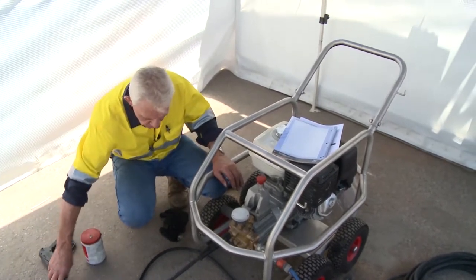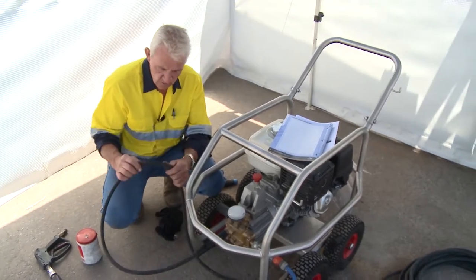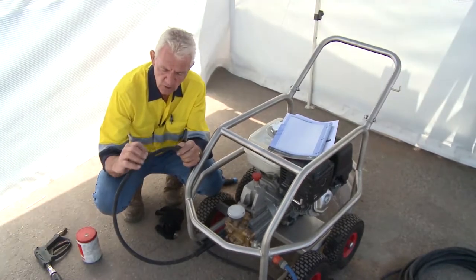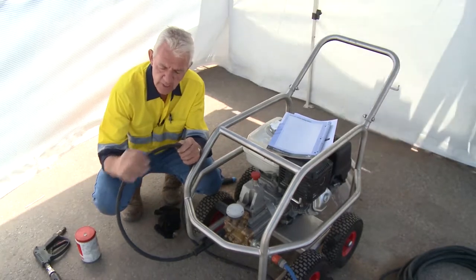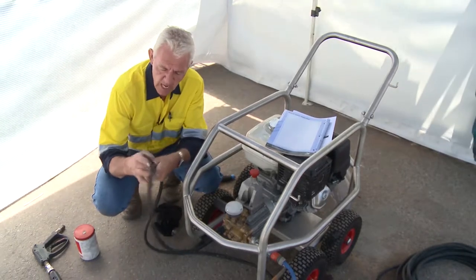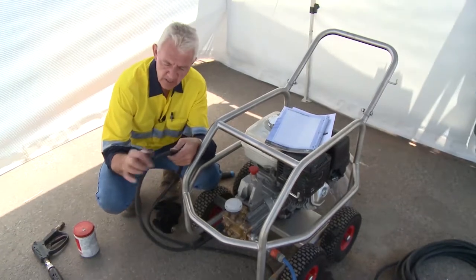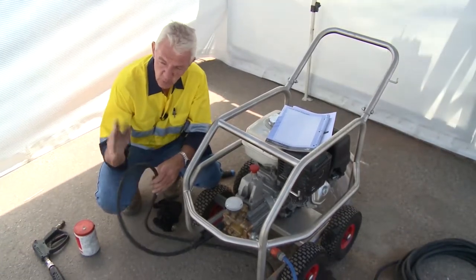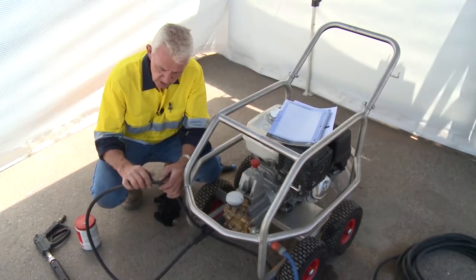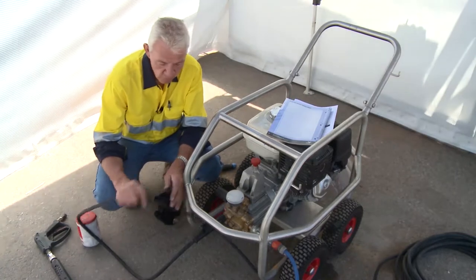Never use a hose rated less than the machine's pressure. These hoses are constructed like hydraulic hoses — wire braid around an internal lining with swaging on the outside. Hoses cannot be crimped; any crimp deems them unsafe and they must be removed from site and discarded. Significant nicks or abrasions also render the hose inoperable.